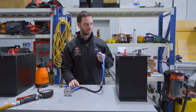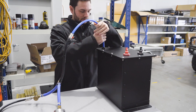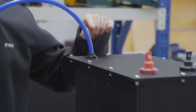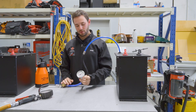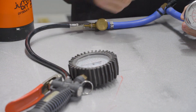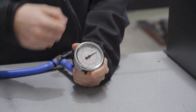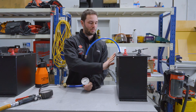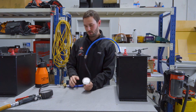Alright, so we'll do the pressure test now. I've put a hose into the outlet for venting of any gases, and we've got a little gauge here as well as our air compressor hooked up. I'll pump some air into the box to get it pressurized, and then we can spray some soapy water to show that it's not leaking — if bubbles appear it's leaking, if no bubbles it's not leaking. So we'll put some air into it.